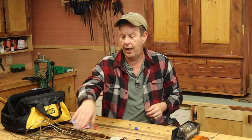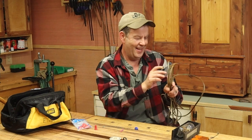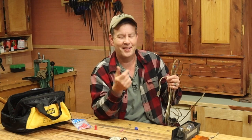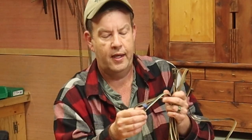The wiring that was on the boat, yeah, it is rough. It should be after however many years. Let's see, almost 30, not quite 30 years. All right, it has Scotch locks on it. This is what the side running lights were actually attached to, a type of Scotch lock. It's got a plug in here, and the side running lights that weren't connected to anything plug into the side here, and I'm guessing they just vibrated and worked themselves loose.